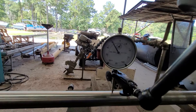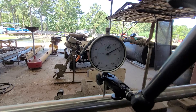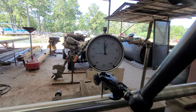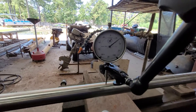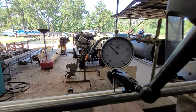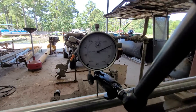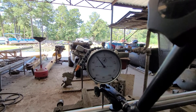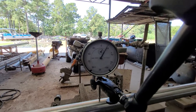As we get to the middle of the shaft that's running outside the boat, we've got five, ten — a little over fifteen thousandths movement. Let's move it a bunch more. We're right at fifteen thousandths still. A little further — another six to eight inches — and it starts to wind down a little bit again. That's a pretty good bend.